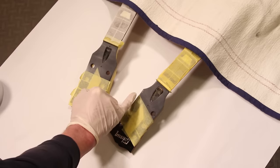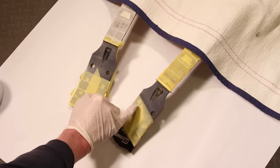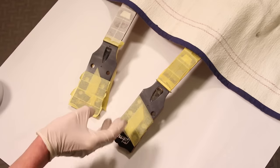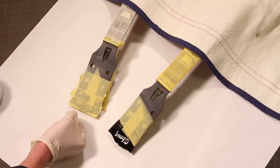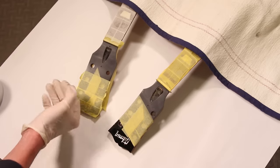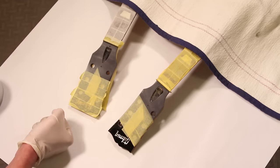Well, I could carry on just painting over that with lacquer, and it would cover those indentations, but over time the lacquer would progressively sink into the crack line and expose those crack lines and those indentations, whereas super glue won't do that. It'll just sit on the surface, so to speak. So super glue is a much better option.